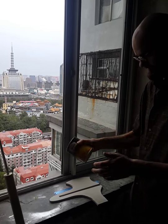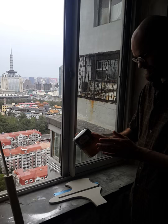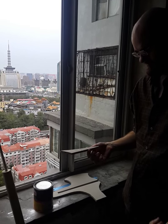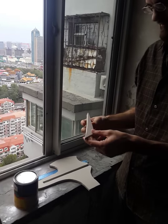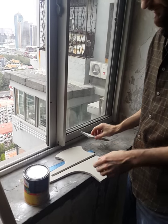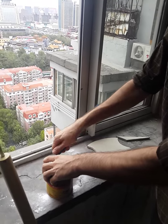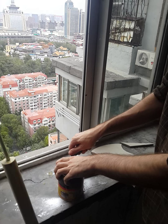This is a unique kind of glue. If you haven't used it before, it's a little counterintuitive. I have this piece of foam here from our cutting earlier — I'm going to use this as my brush. The key is you need to apply it to both surfaces, wait for it to dry, and then put them together.